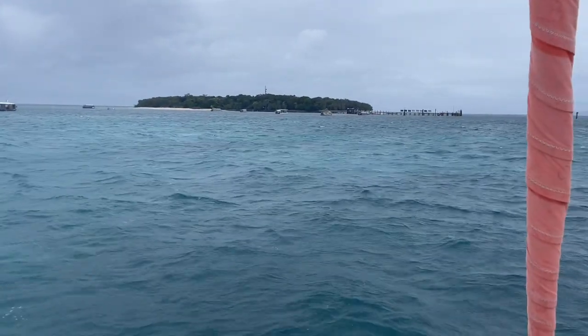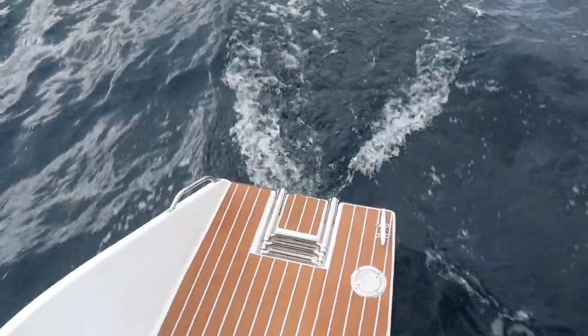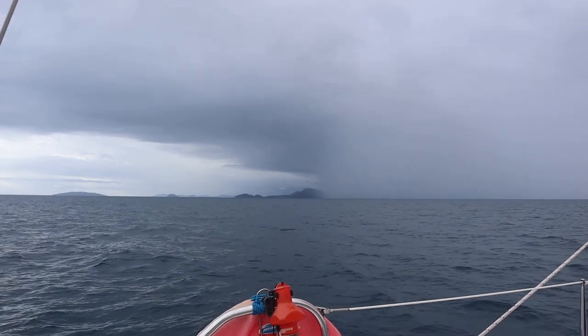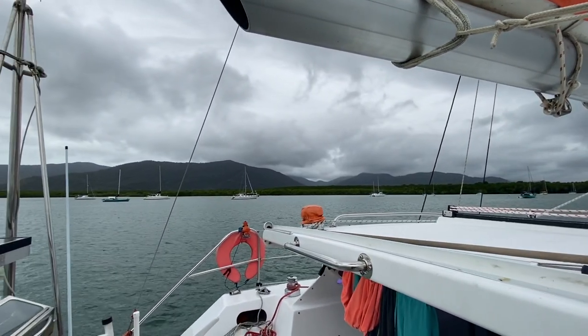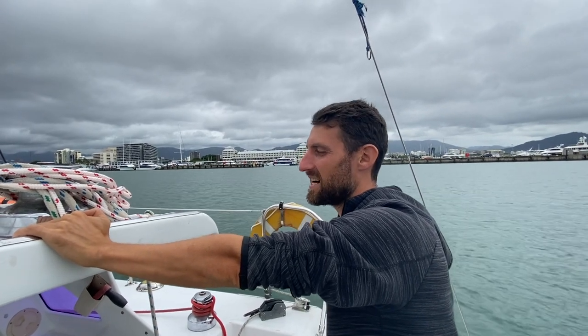Time to leave this windy anchorage and get back to Cairns. The engines are working very well - too well actually, because they're charging the batteries and I don't think we have protection against overcharging. The previous engines weren't charging much so it wasn't an issue, but these ones are putting out around 12 amps per engine. We were already full when we left and they actually overcharged the batteries a little bit, so we're going to have to look at that.